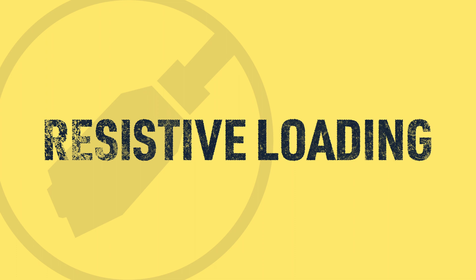Similar to gain, another specification you need to know is resistive loading, measured in ohms. Every cartridge is going to have a recommended loading that you need for your phono amplifier. Moving magnet cartridges load at 47k ohms — 47,000 ohms — and that's the kind of setting that your amplifier is going to have by default. Now, moving coil cartridges are a little bit different; they range typically from 100 to 1,000 ohms. The cartridges themselves will have a range that the manufacturer recommends — sometimes an exact number like 500 ohms, or a range such as 400 to 1,000 ohms. When selecting a cartridge, you want to make sure your phono stage for the moving coil input has the right loading setting.